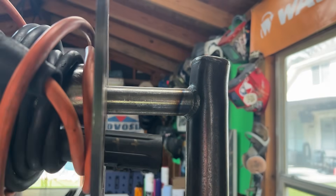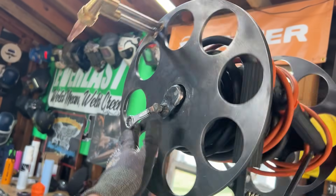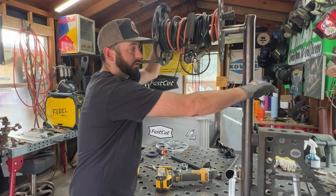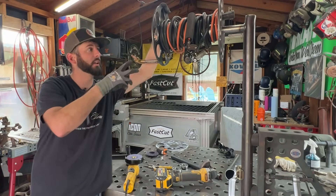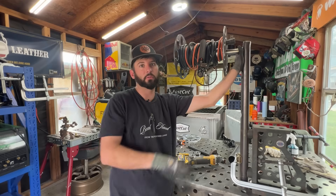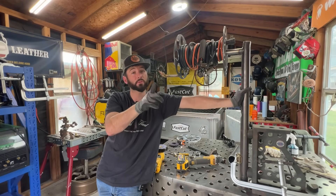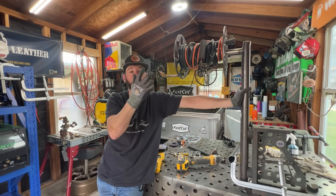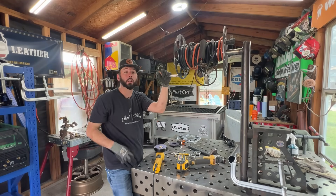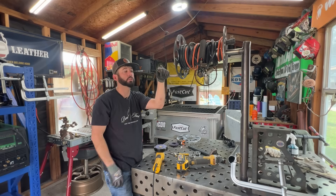Now we look at version 2.0 of the reel setup. I still wanted to keep this really simple. If you look at how a lot of lead reels are set up, especially the ones you'll never have to disconnect — when you plug it into your machine, if you have it bolted to this bolt, everything's live, everything is hot, everything is electrified. So if you have both your positive and negative running to this, you're going to need to isolate your mount. You'll need plastic washers and PVC tube for the bolts so they aren't live. You need to make sure you don't have any arc leakage onto your trailer or truck bed, so your machine doesn't get damaged and you don't damage your welding reels and leads.